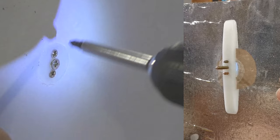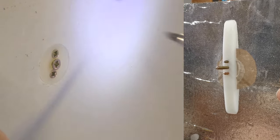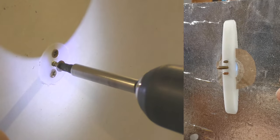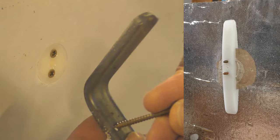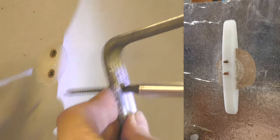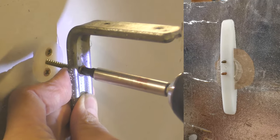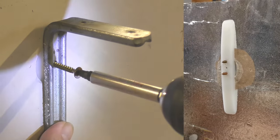You can see that's pulled the plasterboard back a bit because this is a slightly damp plasterboard I've had in the garage for a while. At this point you then remove the larger screw, because it's this screw that you're then using to fix whatever it is you're fixing to the wall.